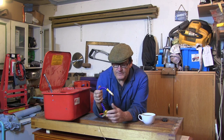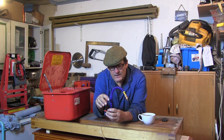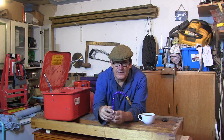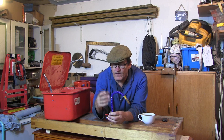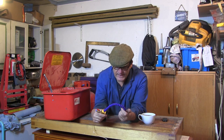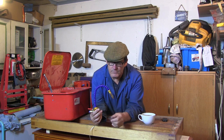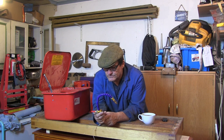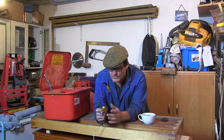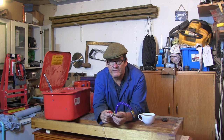One of the big advantages I can see of it, because you've got the air coming out of it, it appears to have a fair bit of poke coming out of it. And with that on the cutter, especially if I'm turning brass, because brass shavings, if you've ever done it, they're like dusty things, they fly about all over the place, they get everywhere, they get up your nose, in your ears, they get in your pants. I think they get in my next door neighbour's pants. And I thought with that, that might at least direct them a little bit away from where I don't want them. So, I'm going to make a little steel bit for this and a T-nut and what have you to put it on my cross slide. And when the airline bits turn up, I'll stick it on the lathe and give it a go.